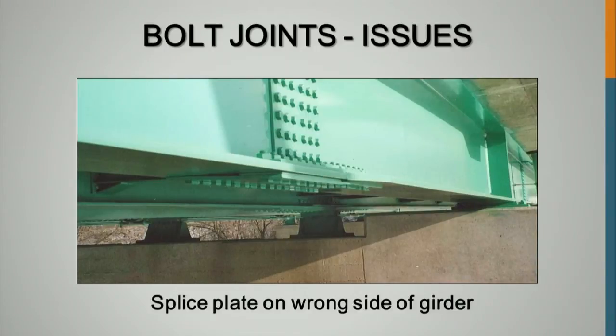But, you know, how did it get by you guys, the inspectors on the job? I mean, you don't accept stuff like that. And all four of them just blew me away. But stuff like that does happen. So you want to look for any gaps between the plates. There shouldn't be any gaps. If there's a gap between the plates, it's automatically something you want to look at.